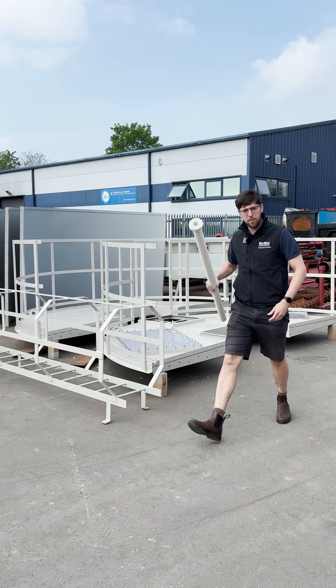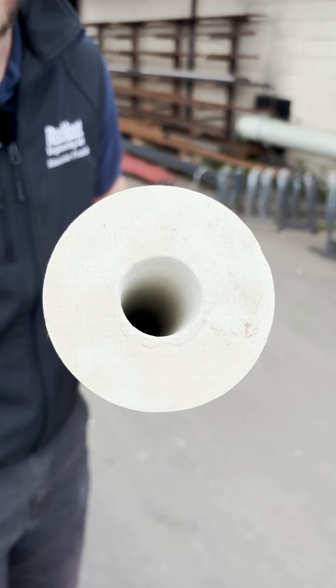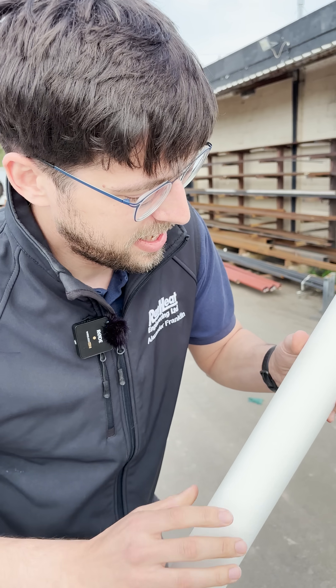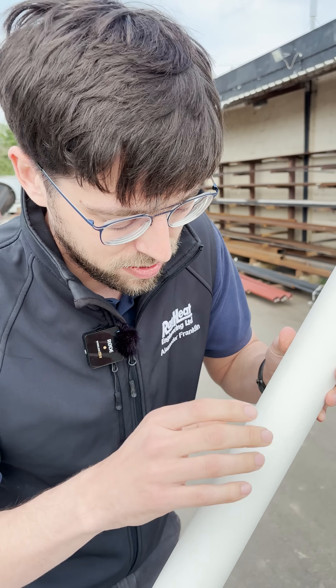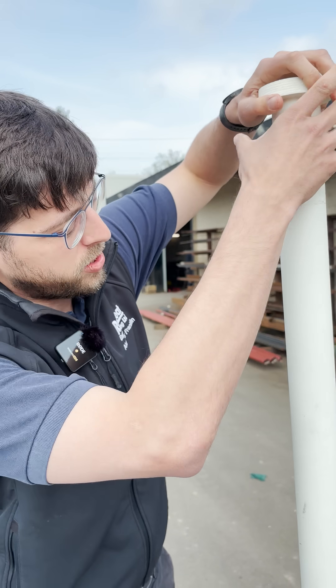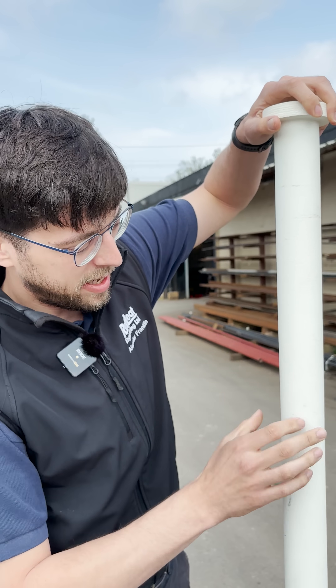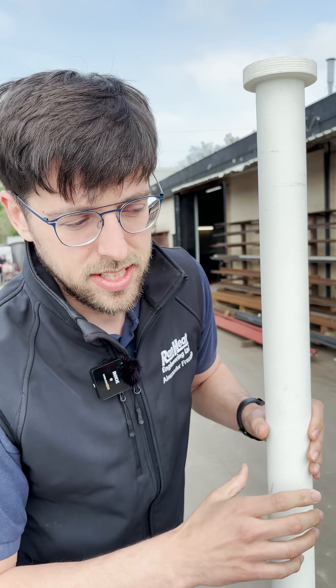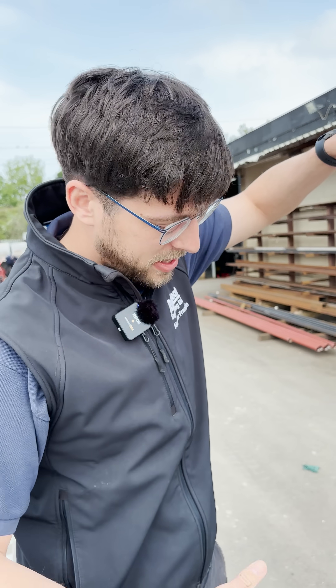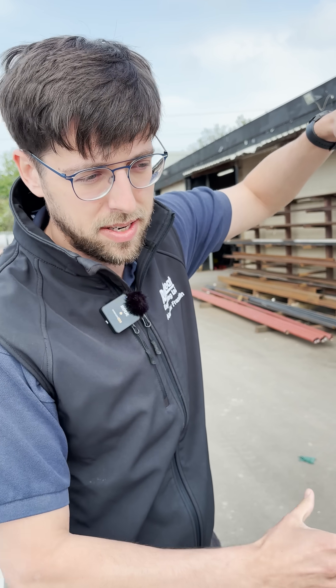Hello, I'm Alex from Ranheat and I'm going to tell you where these go. This is a ceramic filter element and it's a cloth substrate with ceramic impregnated into it. It's done in one long tube and then it's machined down to precise tolerances and it's hung down in filters so it can take the buffeting air as it goes around.